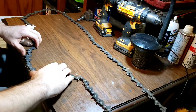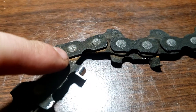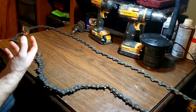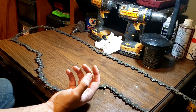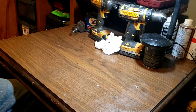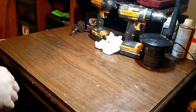Like I said, this section right here - I did break up a lot of it, you can see the rust where it's broke up all the way around. So what we're going to do is dip this back in the Evapo-Rust for a few more hours and repeat this process - dip, break, and repeat. The Evapo-Rust is necessary. A penetrating fluid will get it wet, but our enemy is the rust right now. If you oil this up, that's just going to make it an oily mess - we need to eliminate the rust that's causing the issues between each link. Only the Evapo-Rust will dissolve it, so we'll toss it back in and let it sit a few more hours.